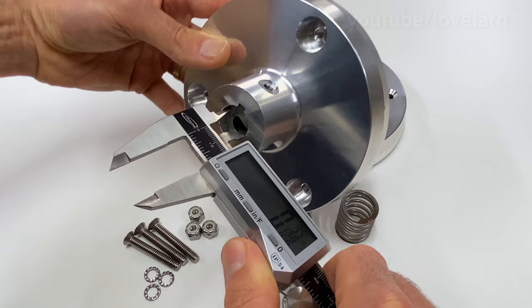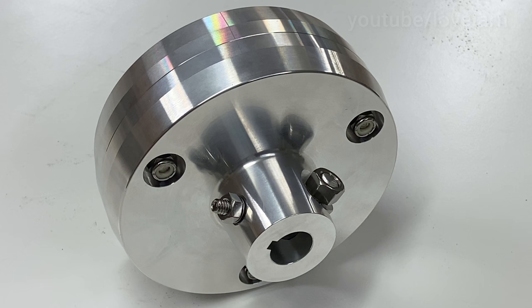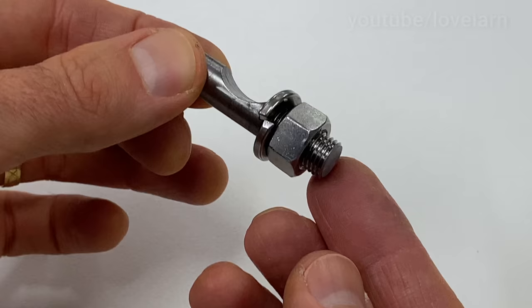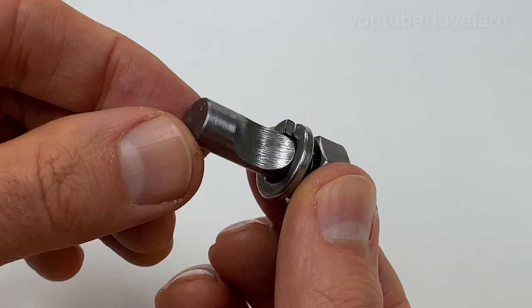This clutch will replace your existing clutch body. It's available to fit 5/8 of an inch or 3/4 inch engine shafts, uses the same cork material in the same place, and engages the clutch cone in the same way as the original clutch design. The clutch is secured to the engine shaft using a key, a cotter pin, and a single retaining bolt or grub screw. The cotter pin is one of George's high tensile cotter pins and is matched to the size of the engine shaft and clutch bore — either 5/8 or 3/4 of an inch.